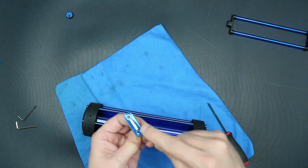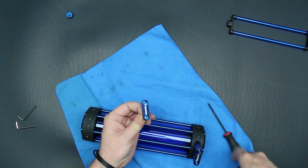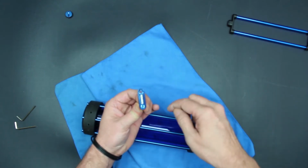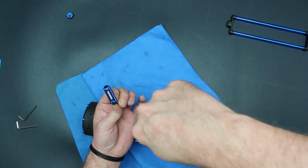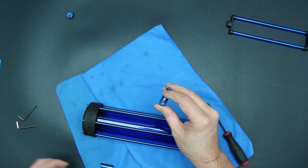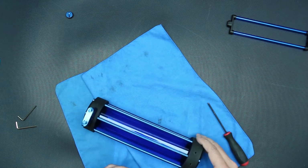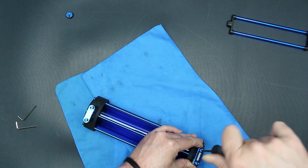This is the spreader bar. This would actually go on the back side of the panel that you're mounting the reservoir to, but just for the purpose of the example, I'm going to put them on like this. What this does basically is two things. It spreads out the load so that you don't have all the weight of the reservoir in one small point. It kind of relieves point loading. And the second thing is, when you drill the holes to mount your reservoir, if you miss a little bit, you can take your drill and kind of round out the hole in the panel that you've drilled to make the screws fit. And this will cover up any little, we'll call them measuring discrepancies. Just barely going to start these.